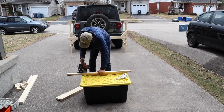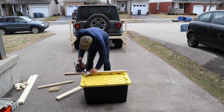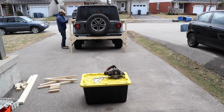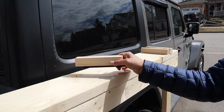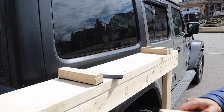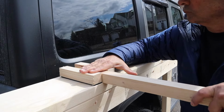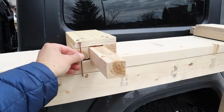We still have to make the mechanism by which it'll allow you to mount that top on that shelf by yourself. Let's have a look. I'm going to use the lumber for my 2x2 stakes and I'm going to cut them 7 1/4 inches long and I'll make 8 pieces. Have a look here at what I'm going to do with them. The plan will be to flank a 1 foot long piece of 2x2 by the 7 1/4 inch pieces. They're mounted on a piece of plastic panel to provide a height difference so that the middle piece will have room to move. A cap of 3/4 inch plywood is held in place by 4-inch screws.